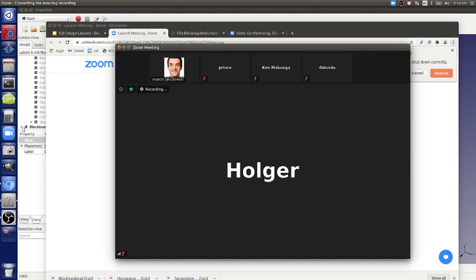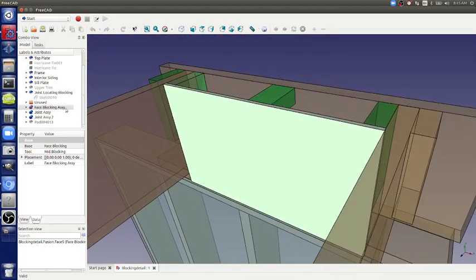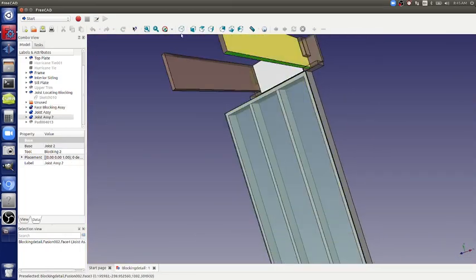So like here you have a ceiling, so you have the joist, and you attach it from the bottom to the joists at the roof. The point is that the blocking on the roof, what do we want to do? We still want to locate it so it's fast to put up. But we don't even need that second blocking, because the second blocking attached to the joist was so we can close it off, the panel closure. We call it face blocking. We don't have this now on the roof, because we're going to put a ceiling, and the ceiling's going to look like this.